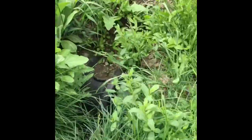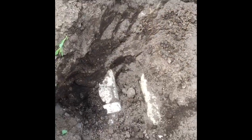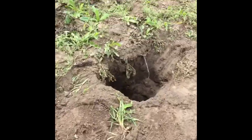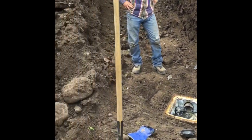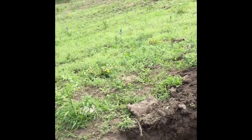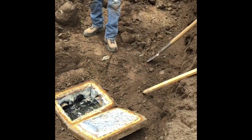What we had to do was work backwards: locate that one trench and keep digging until we found the distal end of it. We kept making marker holes to measure our distance back to the distribution box, taking measurements from the as-built. As you can see, it's buried quite deeply here — unfortunately there's a lot of backfill that got pulled over the septic field and system.